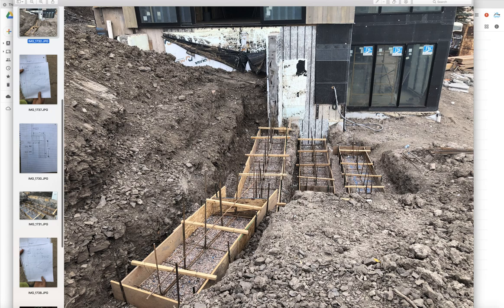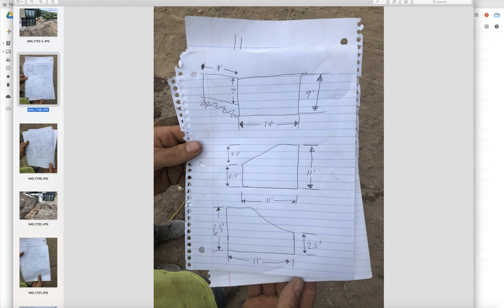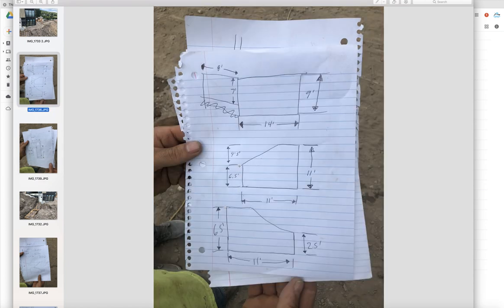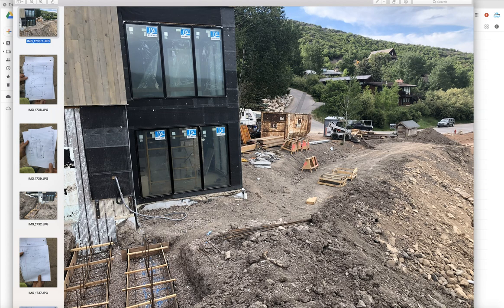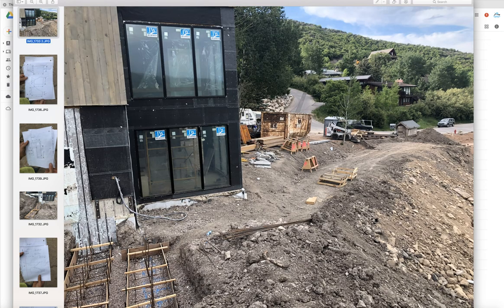That's all retaining wall. That's it, you can see it there. So those are the retaining walls here. This is the first face — it's 11 feet by 6½ feet high — and then it has a slab, and then that goes 6½ feet, and then up another 4½ feet, and then that would meet the rise at the top of the patio, which is right here.